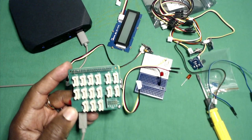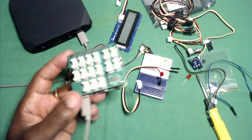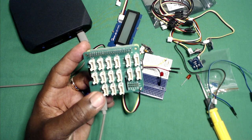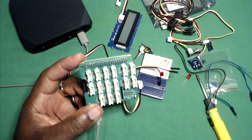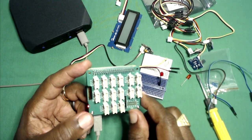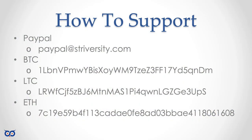In terms of controlling GPIO, gobot seems to be fine - it's blinking. But it's confusing why it can't do the signaling to control the motor. This video is much longer than I planned. Next time I'll come back and try to get some of the other ports to work, like the analog port with the rotary sensor and the touch sensor, and maybe get the LCD working too.